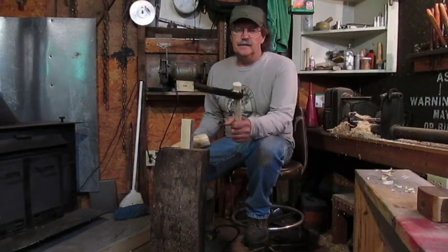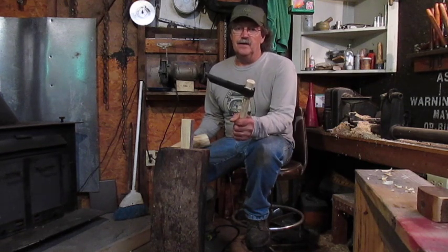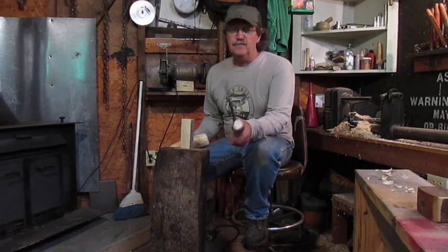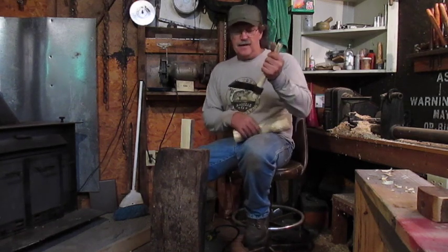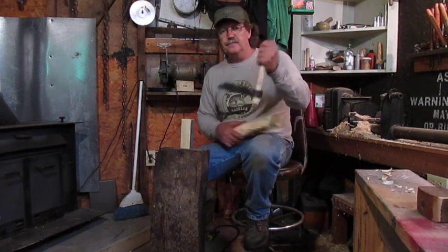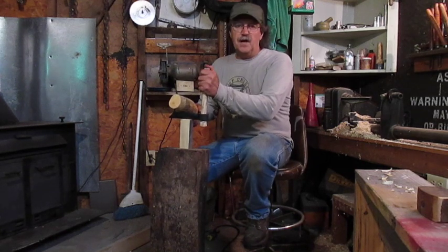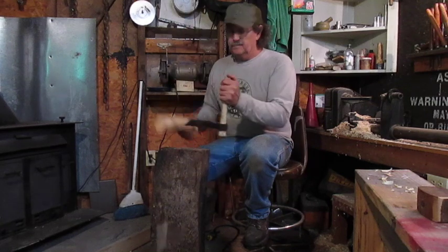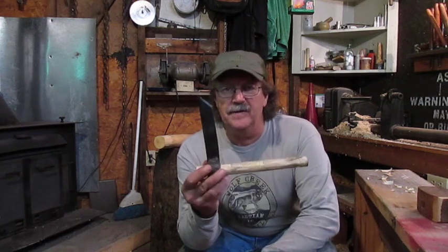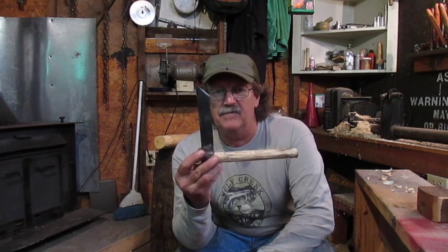Here's the finished product. This project took me three and a half hours from start to finish — videoing, hammering, and heating. There's the finished product. It's not actually perfect, but I took and whittled a handle out. By the way, just whittle your handle wider at the bottom end so that when you're hammering, the thing gets tighter on the bottom. All we're doing is taking this to the woods — instead of using our knife to chop kindling wood, watch this. That's what a froe's made for, guys. Make yourself one of these things, let me know how it turns out, and thanks for watching Bland County Survivorman. That's another tip from Bland County Survivorman. Have a nice day.